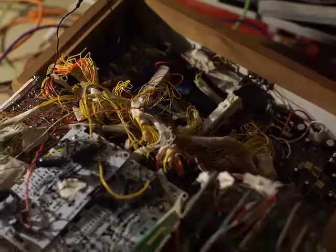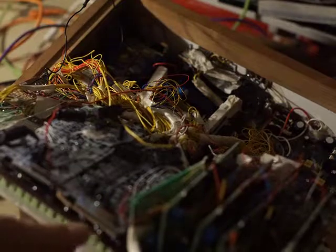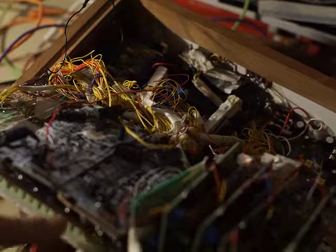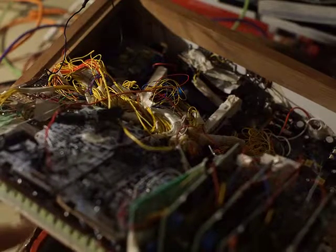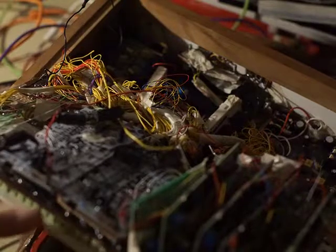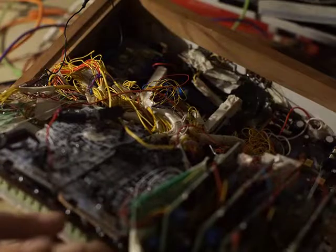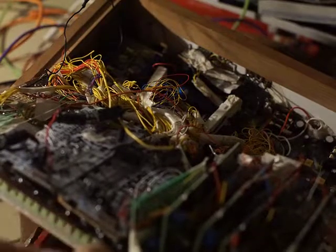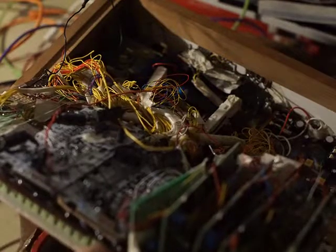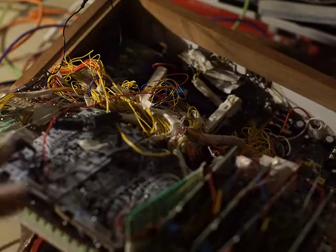Under here there are the passive connections. They're all made on the board, and basic passive summing connection. There are 4K7 resistors, then there is a 20K pull down for interference, but just on the stereo sum.